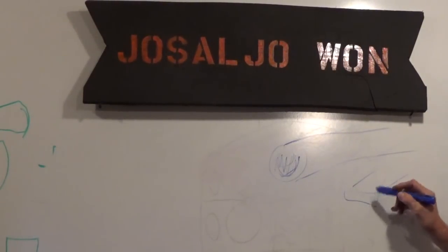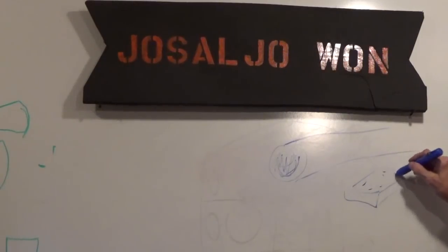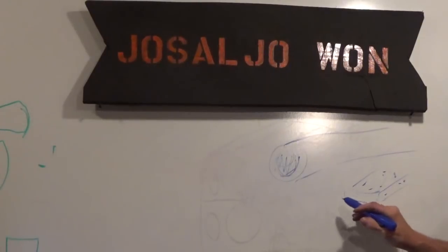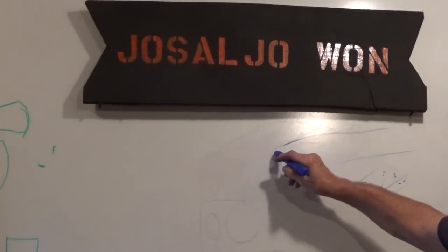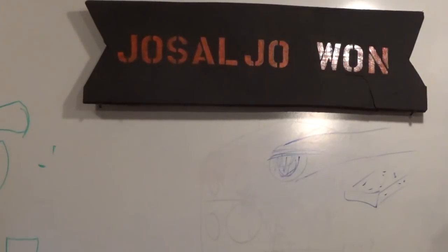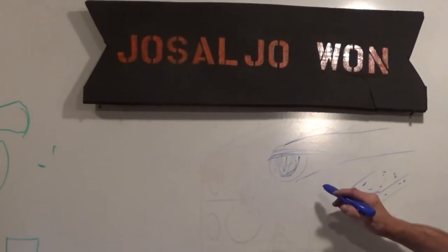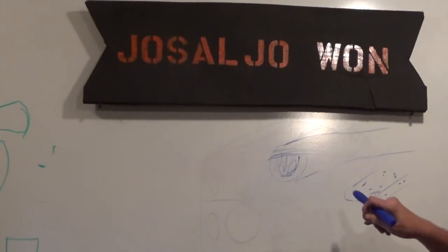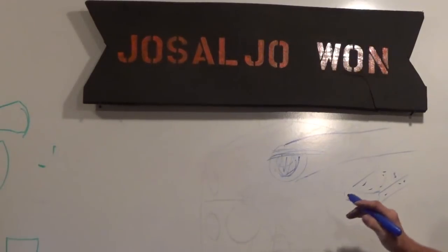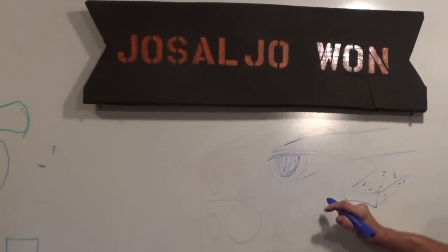Because when you have boards, you end up with the possibility of getting paint spatters all over the place, on the ground and everywhere else, and yourself. You're better off just doing it here, and then when you cut the boards out of here, you'll already have them end coated. So that's number one, okay? That's one of the things that I believe you should do. The reason's obvious, first of all. Anything that will keep your lumber looking good is a plus. Anything. So no matter whether it's end coating or how you dry it, you want to keep the lumber looking as good as you can, okay?